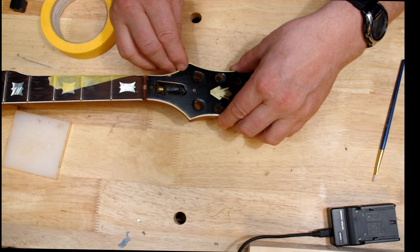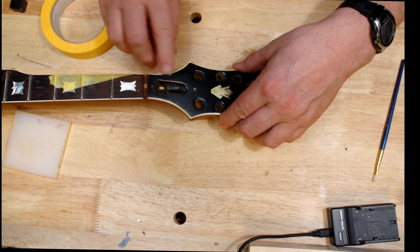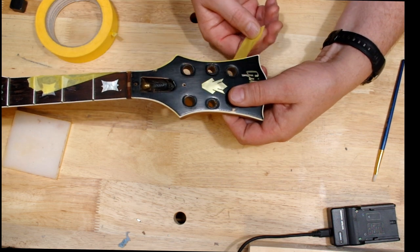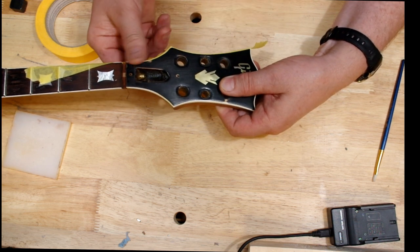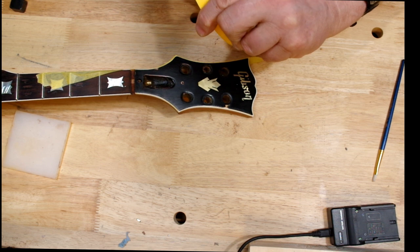And that's a great advantage, but if you put it on wrong, you put it on too thick, you don't let it evaporate fast enough, you touch it while it's wet, all kinds of things will then damage the finish below. And that's something I don't want to do today, or take the risk of applying finish over the old and actually end up ruining the old, because I want to preserve everything we have here.